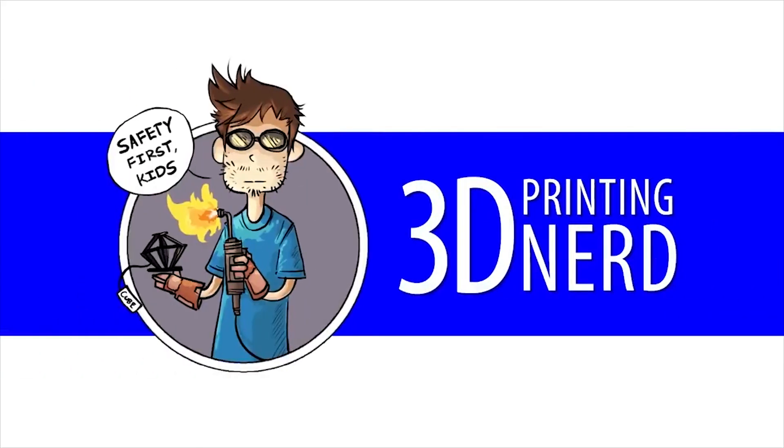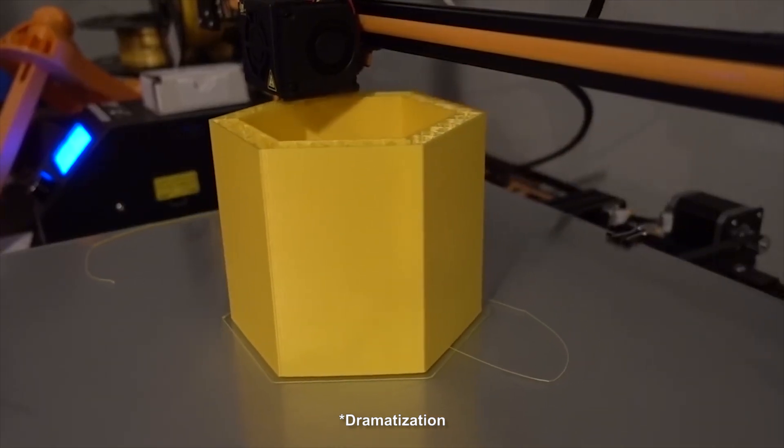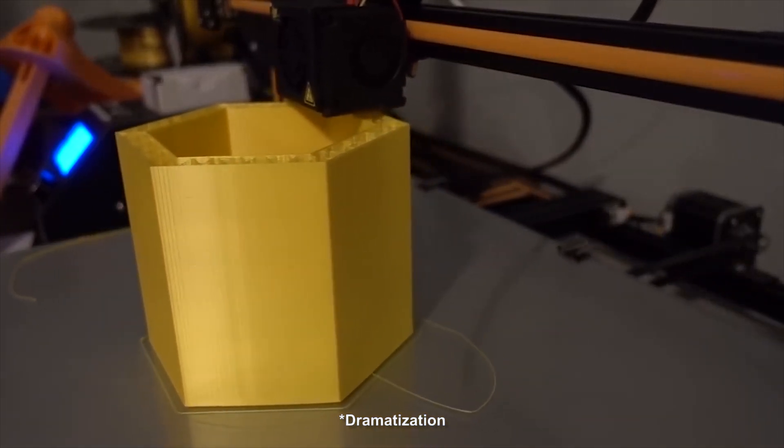Cool crazy future 3D printed things I can hold in my hand. We all know FDM style 3D printers — printers that have plastic being sent through a hot end and extruded out of a nozzle. And we know SLA and DLP 3D printers, the types that use a resin with a build platform that lowers into the resin, and a laser or an LCD screen cures resin in layers as the build platform pulls the model out of the goo. But what is SLS 3D printing?